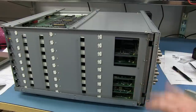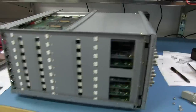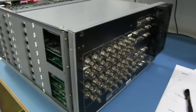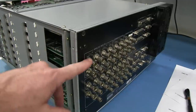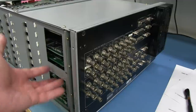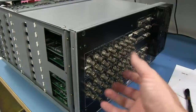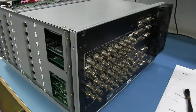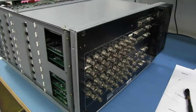I'm not sure if they're all parallel connected and you can just put the boards in any order willy-nilly, or whether or not I think they are in specific slots, because that's what the manual tells you. There is a specific order the boards go in, and some are presumably specifically wired through to the outputs like this, so that'd be part of the system, because you don't want to waste a lot of the pins that you have to dedicate to all these output jacks. You want all those to go down to one or two boards on your backplane. You don't have to waste the pins on your backplane connector in here, because you need those for all the digital board-to-board interconnects and all that sort of stuff. So yeah, I'd wager decent money that that's actually the case, how these things are wired together,